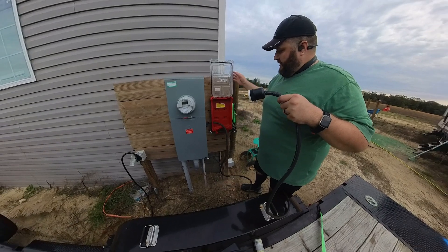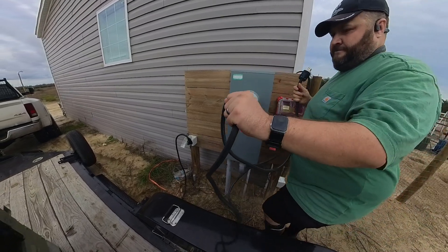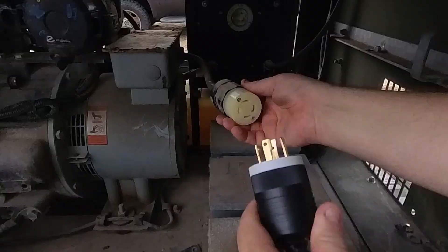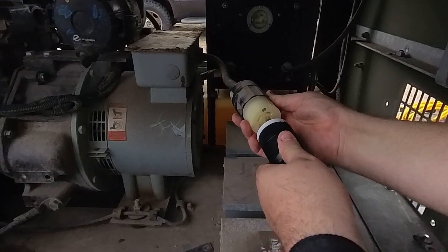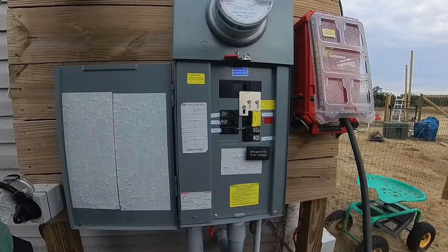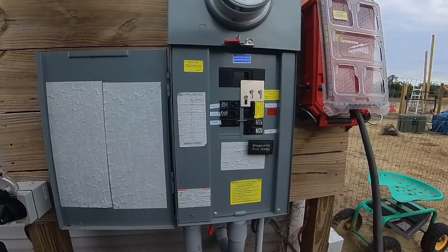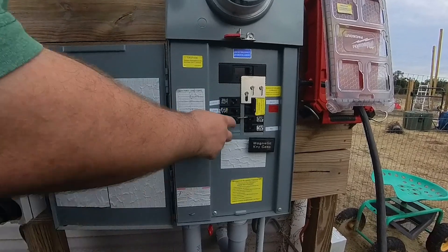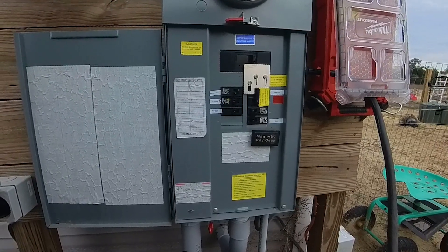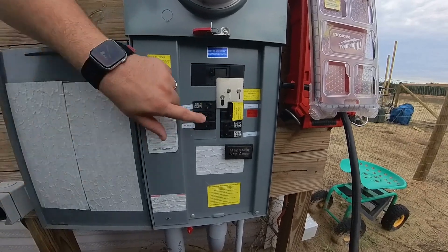You can quickly deploy it when you're ready for an emergency like we're testing today. We need to go ahead and plug the house into the generator, making sure we keep the load off on the house until the generator is fully up and running. When running a backup generator, it's important to shed any excess load you don't need. I've already shut off my water heater and now we're going to shut off the RV pads attached to my house, so we only run the essential stuff off the generator. And shut off the house main — the main power coming into the house is now off.